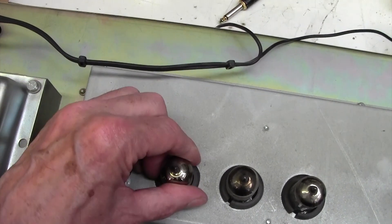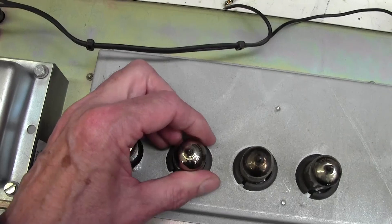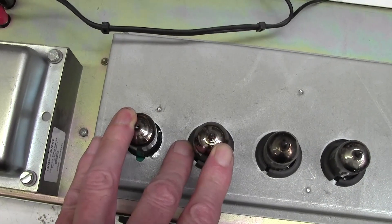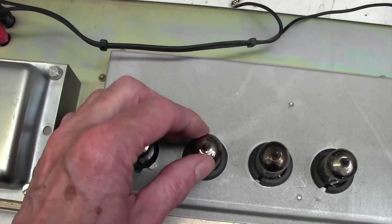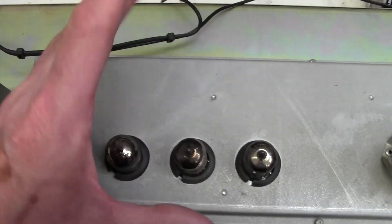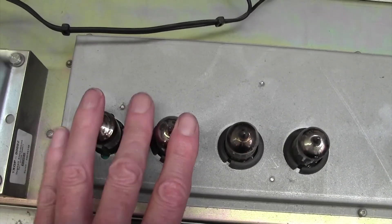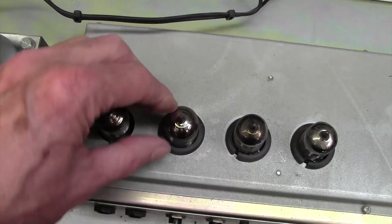Then I put my hand on this valve and it's also stone cold. We have two cold valves here. These other ones are warm, almost too hot to touch, and of course the power valves are hot. So these two valves - the heaters aren't working on them.